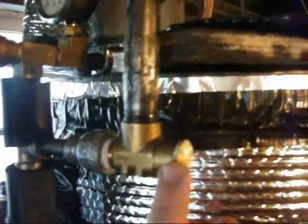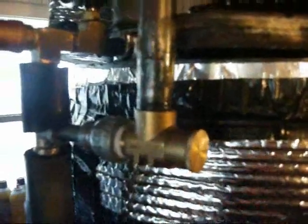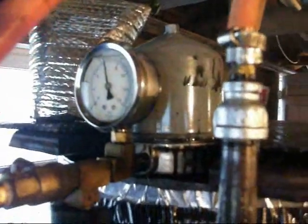And this is how I control the pressure. And this is a safety valve. It's preset factory at 75 pounds per square inch. I pop the cap off of it and run the spring pressure down. It's adjustable. I run it up to about 100-110 pounds per square inch, and it'll blow the oil back in the processor if the centrifugal filter clogs.